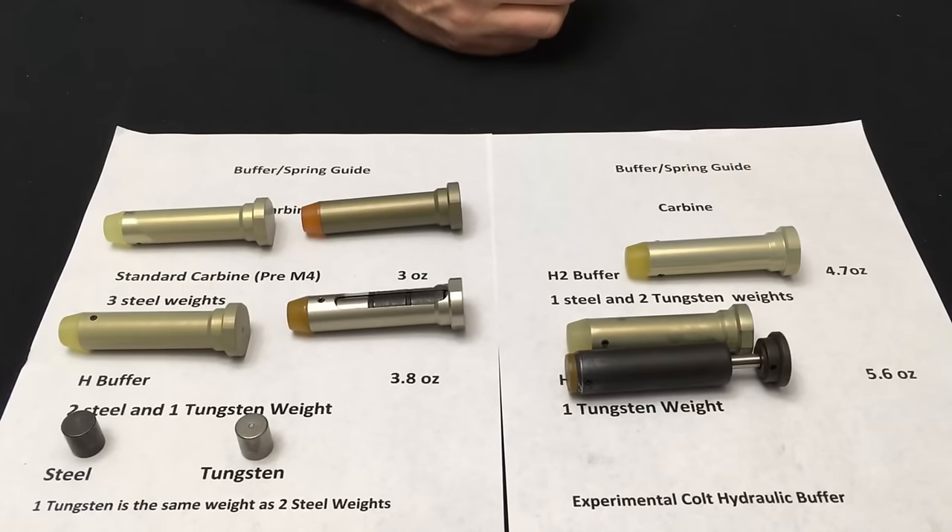When we got back to Colt we finally got them to do some research. They did high-speed video and figured out what we had told them was going on. The solution was mainly a spacer — about a half-inch long — that went in the rear of the buffer spring. When the bolt came back on the 9mm it would stop at the exact same location as a standard 5.56. This kept the trigger compartment covered at all times and also stopped the bolt right before the bolt catch, which eliminated the acceleration time from rearmost position to closing on the bolt catch. This made a major difference in reducing broken bolt catches.